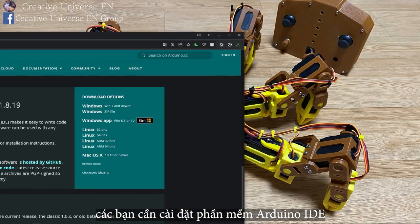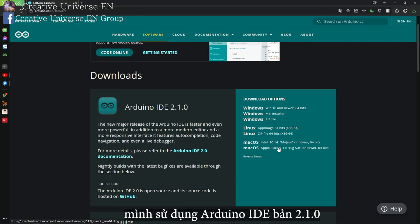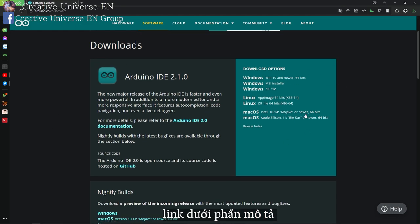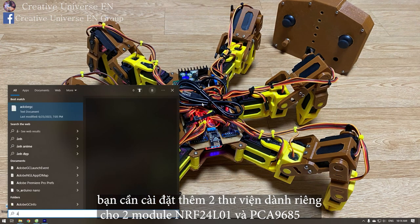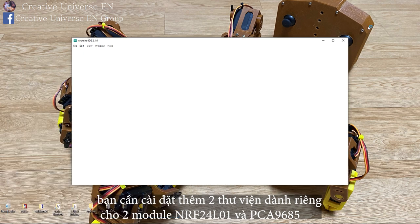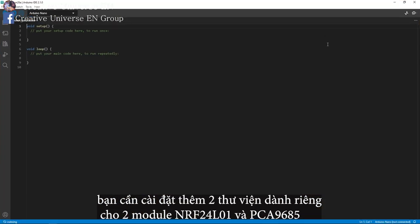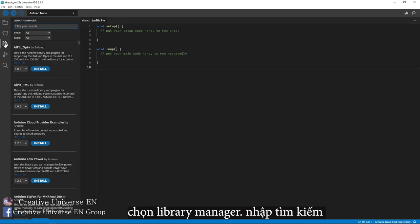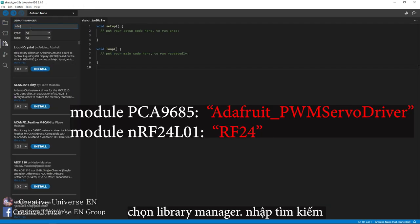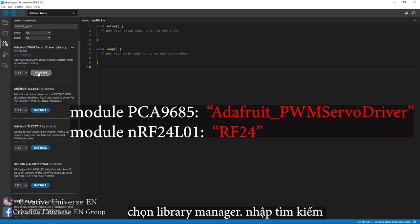Now you need to prepare the Arduino IDE software. I'm using Arduino IDE version 2.1.0. You can download and install it from the Arduino homepage. Link below in the description. After installing the Arduino IDE, you need to install two more libraries specifically for two modules, NRF24L01 and PCA9685. To install the library, click on the Library Manager, enter the search terms Adafruit_PWM and RF24, select the latest version and install.